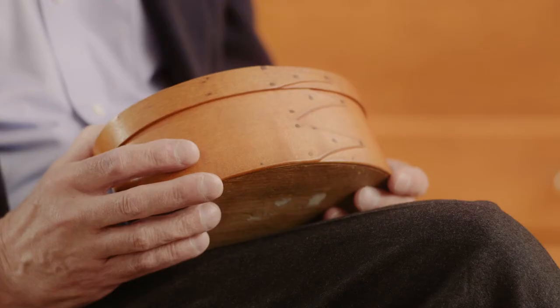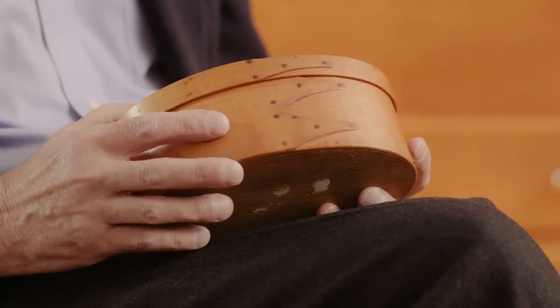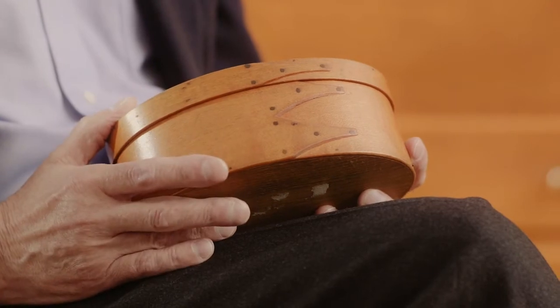The flaw usually had to do with the way that the overlapping sides of the box were joined. The rims — the Shakers called the sides the rim — had a propensity to buckle and crack over time. This occurred because there is a normal organic response to seasonal conditions that wood goes through. The Shakers developed a unique form of lapping or overlapping one part of the bent wood body of the box to the other.